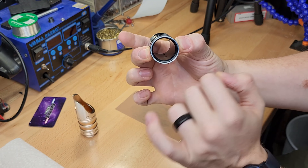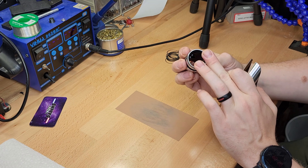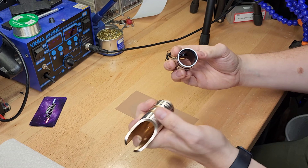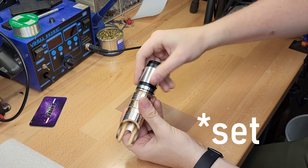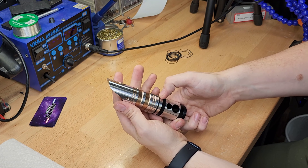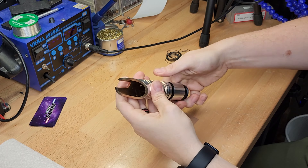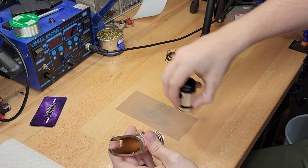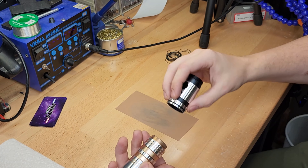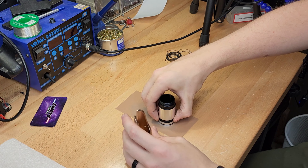You can see that this has already taken off most of the anodize. Make sure the surface is clean because if you've got some kind of debris in between it'll give you a false screw together — if it's getting hung up on a little piece of grit then it's going to seem like it's stopping shorter than it really is. Where if you clean it off it'll go all the way together. I always recommend just do a little bit at a time until you get the feel for it, because it's way easier to take a little more material off than it is to put it back on.